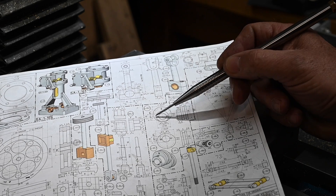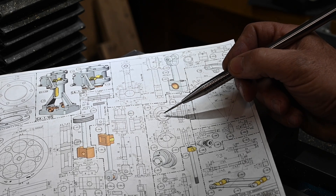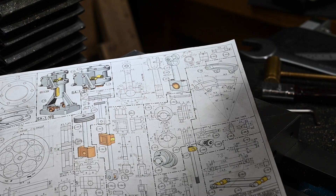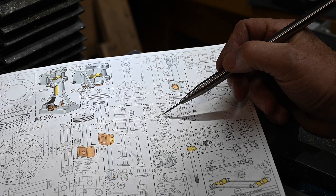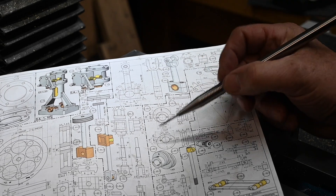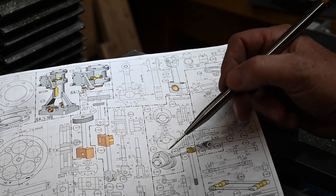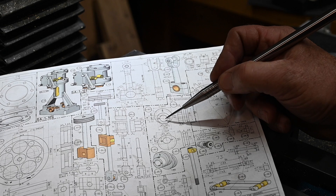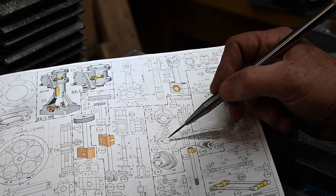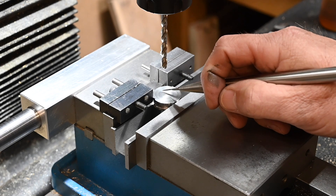That 3.5mm offset is also the same line for the pins. I think I'm going to do them undersized initially, then maybe put the pins in and drill them both with the pins through — final drill them both with the pins in position. So I'll drill them 9 millimetres for now and then drill them out to 10 millimetres later. Right, I'm now centred 3.5 millimetres back and I'm going to drill my hole.